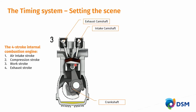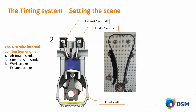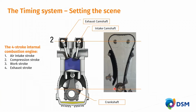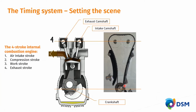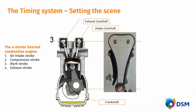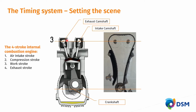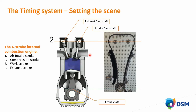of the combustion engine. Now, to keep the movement of the piston and the valves in timing, in synchrony, there is a timing system, which in most engines is laid out with a timing chain that runs on a sprocket on the crankshaft, and that drives two camshaft sprockets, the camshafts, with lobes that operate the valves to get the air in and out of the engine.